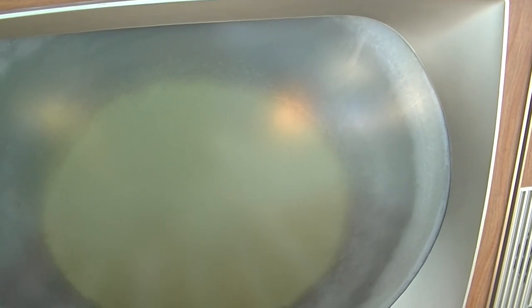The safety factor is largely lost because you don't have that three-layer bonded laminated setup. So you just can't kick it or throw footballs at it or abuse it. You have to treat it very delicately. There's really no other alternative at this point that is easy for the end user to do, and no one rebuilding CRTs that could safety band it or reapply the clear bonding agent. So you have to accept that you no longer have a bonded safety lens CRT, and there's an element of fragility. You have to treat it as such.